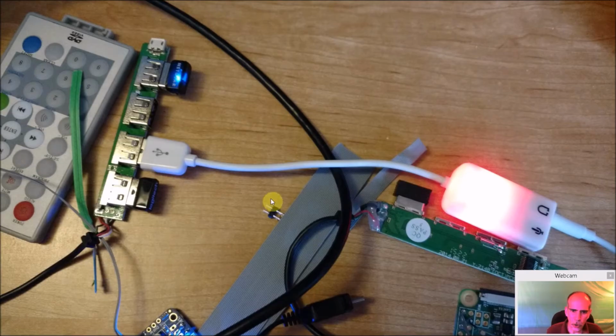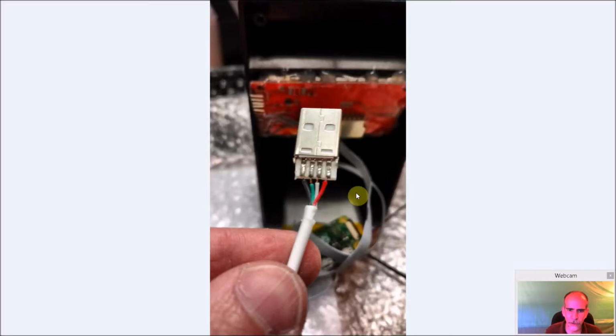So when you open up this here, and this cracks off pretty easy, just put a little screwdriver in here. These 2 halves just pop right off. It's not held on in any difficult way, neither is this. A little screwdriver in this spot right here, and these covers will pop right off. So I popped this one off over here to expose this. So you can see your power, your 2 data lines, and your ground. And I'm basically using my soldering iron, just touching each one of these. These wires came right off, no problem.